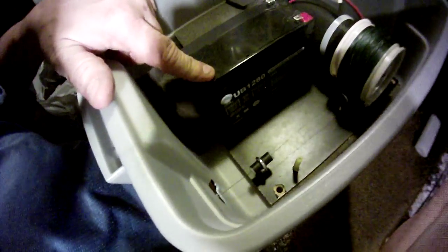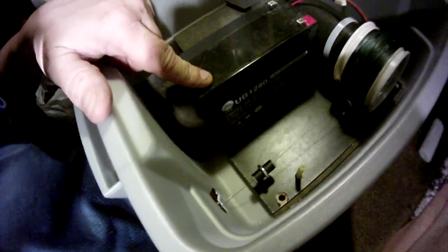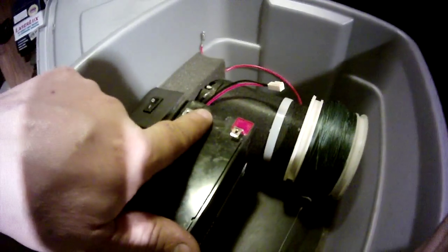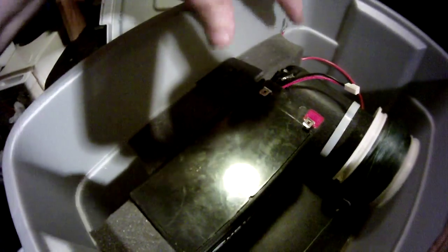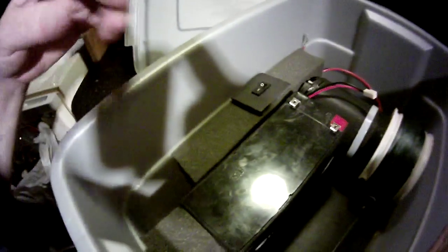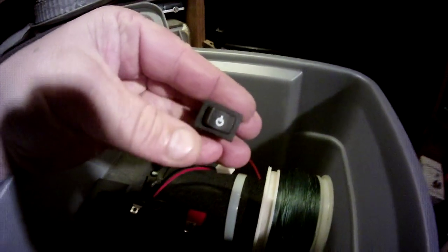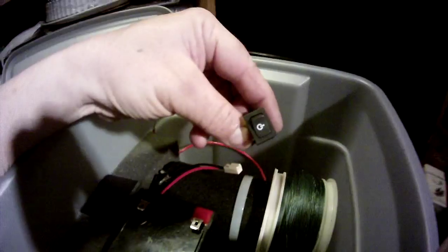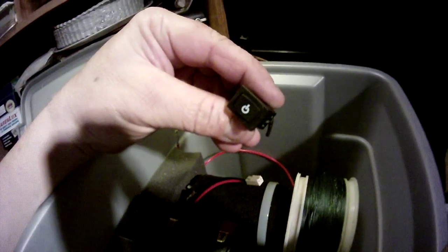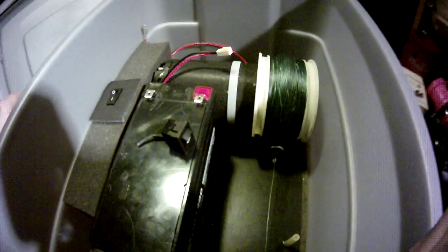Here's your battery — it's 12 volts, 8 amps. Should be way more than enough to run this motor for a long time. I just need to pick up the wire clips and install those. This is going to be your on-off safety switch right here so you don't have any chance of this thing firing off when you press the button. I'm going to give you this little toggle switch on a post like a handle, kind of like a joystick. I'm going to run the wiring out the side so it's concealed — everything will tuck back into the bin and you can put the lid on and throw it in the trunk of the car.